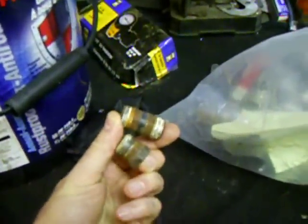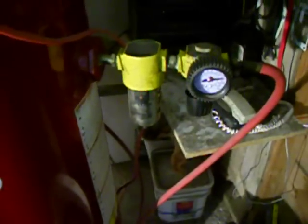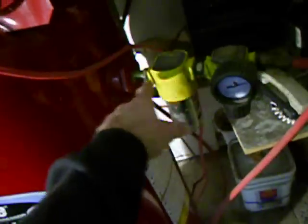One note about hooking up fittings to an air compressor: don't buy cheap steel fittings. They're great for water, but air will leak when water won't. I went through this already with regular cast-iron fittings — they were cheaper and they leaked, even with Teflon tape and pipe dope. Just spend the extra two bucks on each fitting and get brass fittings. If you Teflon tape them and put pipe dope on top, that's been several years and they haven't leaked at all.